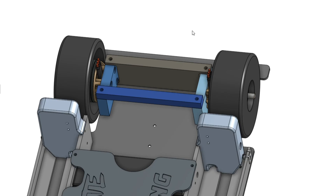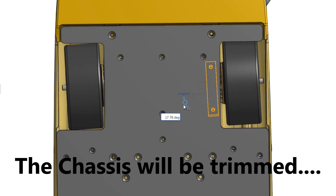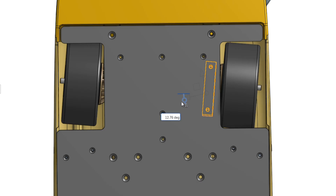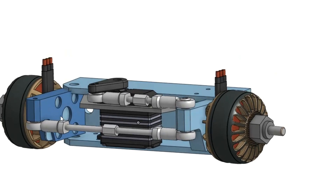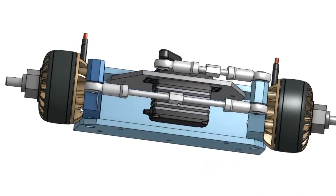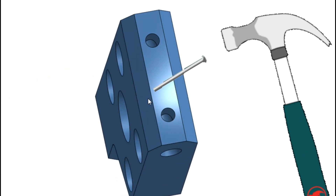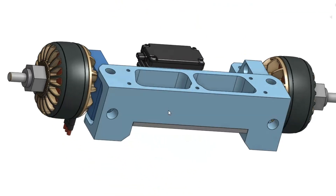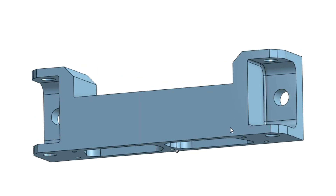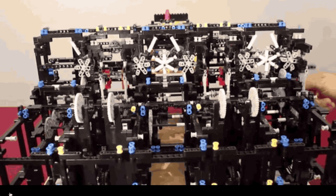I started with this very simple layout, bolting a cross-beam directly to the chassis with some steering arms attached. I had moved the front wheels inwards by 4mm to give clearance to the body while achieving 8 degrees of steering lock and an 8m turning circle. But things quickly got more complex, starting when I added a fairly essential steering servo. I was looking at making the parts out of some materials I already had, but I didn't think I could make them with the accuracy required in my garage. So I decided to embrace the complexity and order the parts to be CNC machined by PCBWay, after the good experience I had with the flywheel for my motor dyno. So now complexity was okay — probably not a good thing for me to find out.